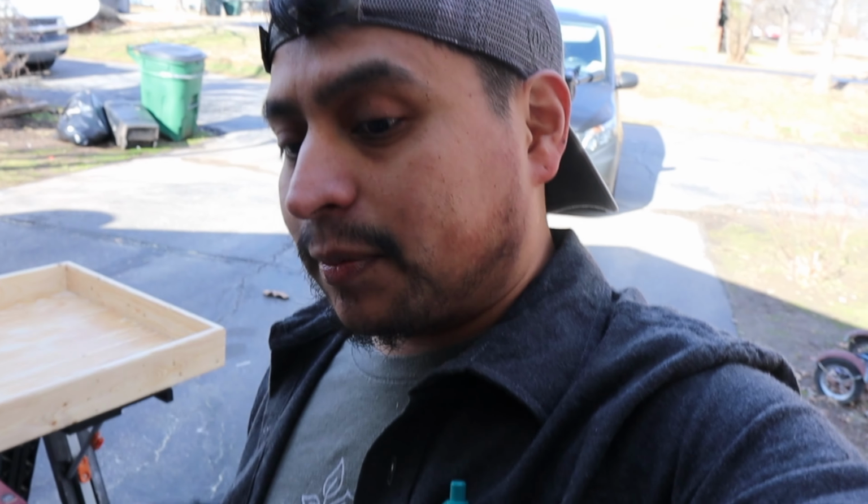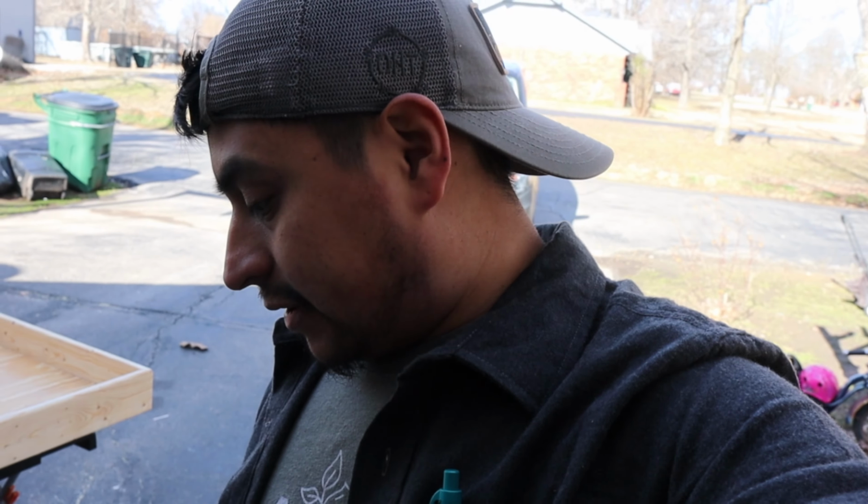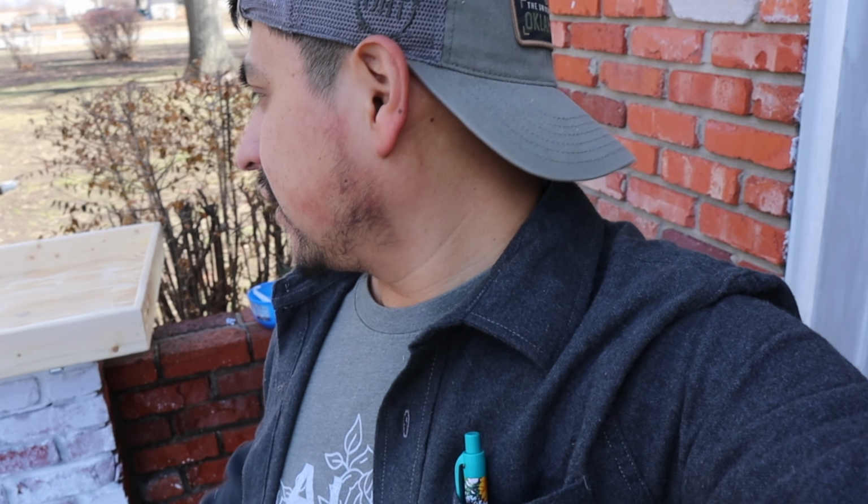We did spray water-based poly, so it's a little bit thicker. We had to cut it down. What else did I not like? The hose is kind of short, so it's not the same as spraying with an airless sprayer with the fine finish. But the finish, the way it was coming out, it did resemble a fine finish airless sprayer. We sprayed with the Graco 390 and with the fine finish tips, and it felt like that.